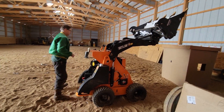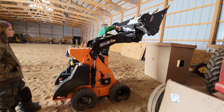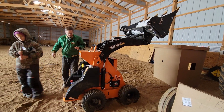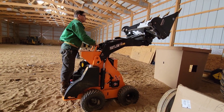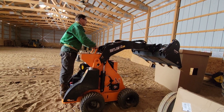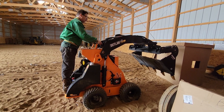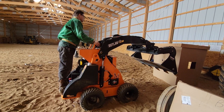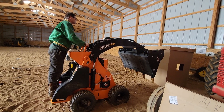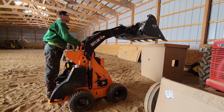I'm just going to lift it up here and work it through its paces, kind of see what it can do. It actually goes up quite high, which is very nice. I like it a lot. I'm going to be able to quite easily get over the top of my skid steer dumpster and dump in. I noticed some zip ties attached to hoses up front when I connected it up, so I'm just removing those so I don't break them when I open the bucket. This four-in-one bucket has teeth on the front so I can dig into the hay and push it, and with the four-in-one I can also open it up and grab things. I'm still going to invest in a grapple so I can pick up logs and huge piles of hay, and I'm probably going to put a small bale spear on it to move six to seven hundred pound bales around the farm.